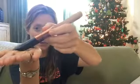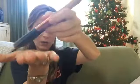There's a technique that I've had a lot of success with where you take the whole piece that you're working with, like the whole side of the dresser or the whole drawer, whatever section you're working on, and you use this to roll on your paint in thin layers, and then you're gonna go back with this flat brush, and from one end to the other, you're just gonna barely touch the tip, not press down, barely touch the tip at an angle and lay off your paint.